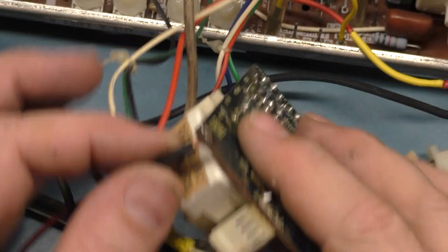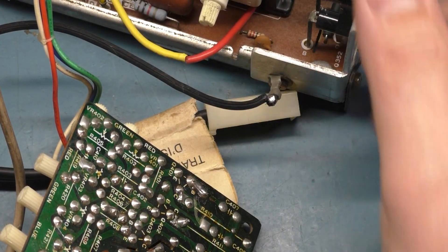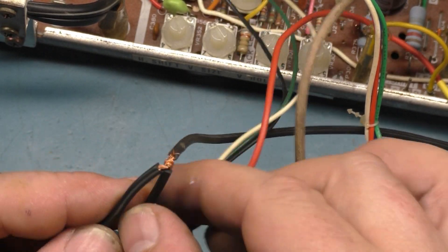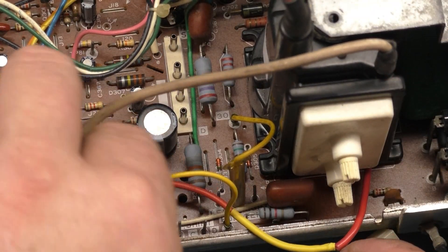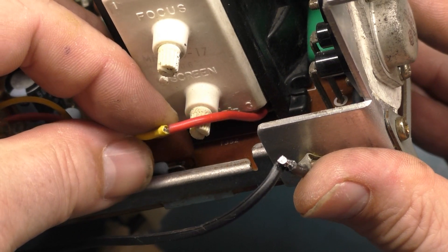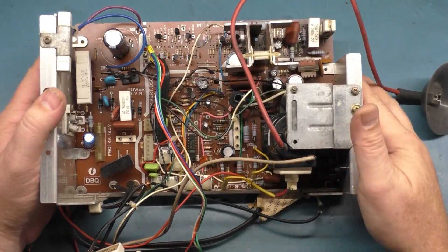The ground wire is frayed and broken, and it's also spliced in with the ground coming off the frame here that is soldered on. All this stuff here isn't even covered — not that it matters, but if it grounded to something on the neckboard with power, that'd be bad. So this needs to be covered up and fixed. Then we have the G2 wire — I noticed when I was hooking the chassis up, the G2 wire is actually exposed. We need to fix that as well.